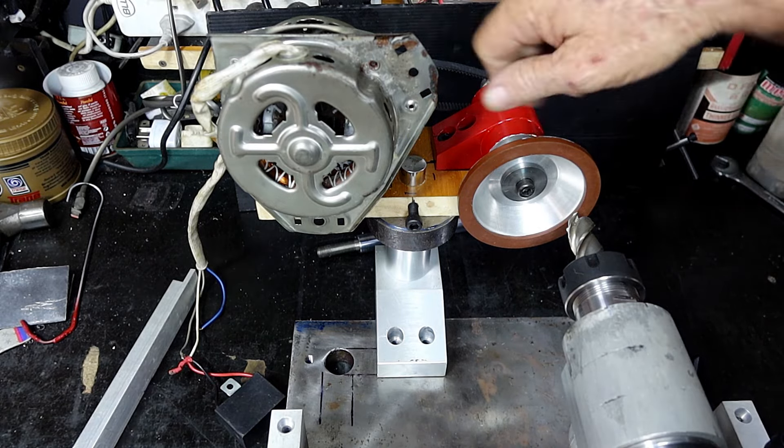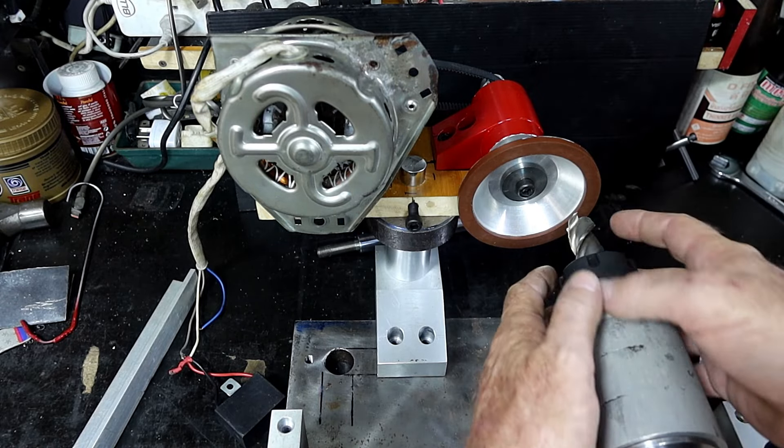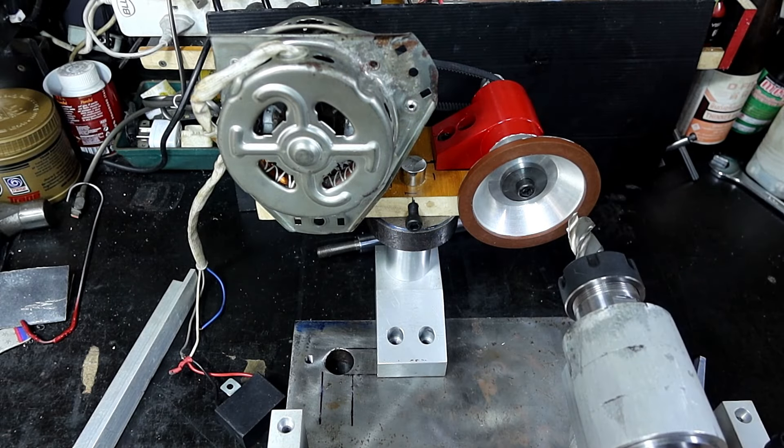The belt's perfect, this sits in an okay position. I might actually move it back just a little more so that I can get down into there to put the adjustment. I need to make it adjustable up and down because as I pivot this thing across, it moves up and down, so you need to be able to move this up and down to maintain your center line.